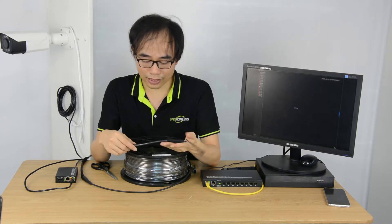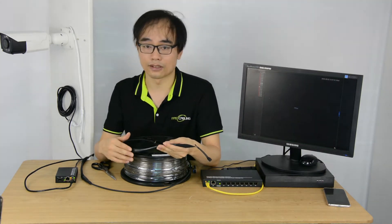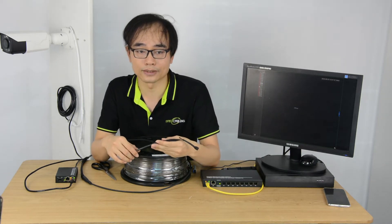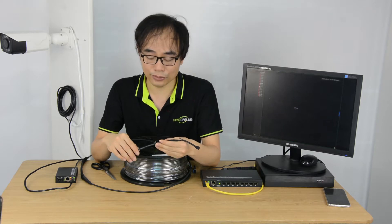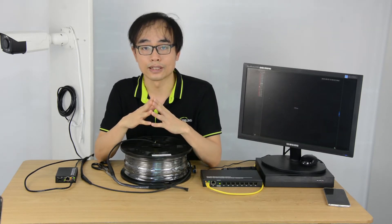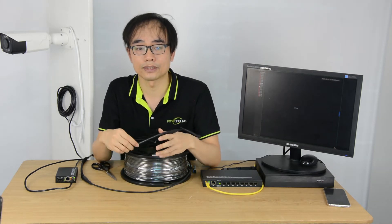It's simply light transmitting in the fiber optic cable, so the connection has to be precise, otherwise the signal could be deformed. Even a single dust particle trapped between the two connectors is going to make the light being divided.